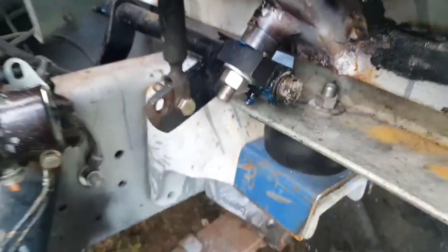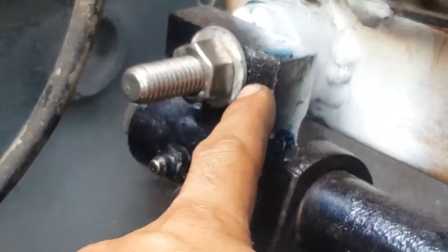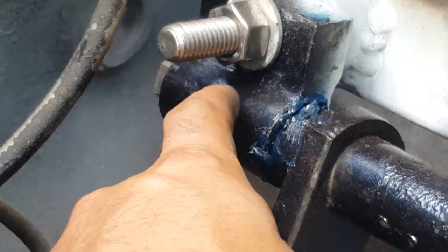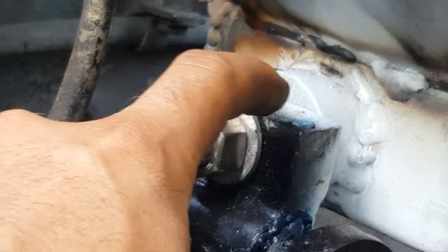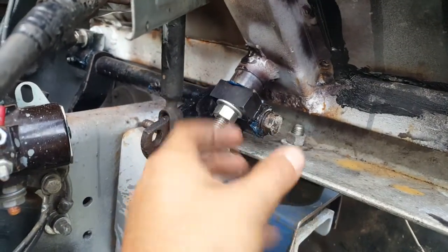I'm really satisfied with this setup here. I got a piece of block steel — not even plate steel, that's block steel — welded it to a piece of solid pipe that I drilled to size. Then I drilled the hole there and welded that thing on with the bolt on the other side. This required a lot of machining work. I drilled through and left a countersunk hole — a bigger hole and then a smaller hole — so the bolt won't go all the way through, just go in. Then I welded the end, sanded and ground it off, and welded the whole thing around there.